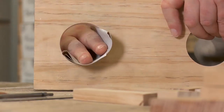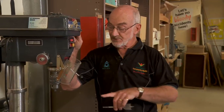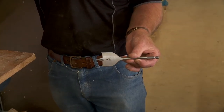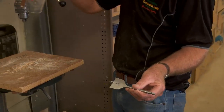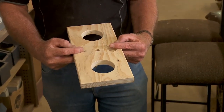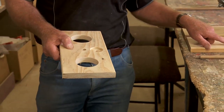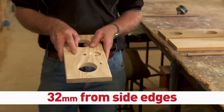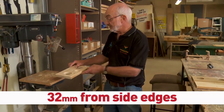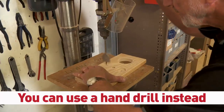Just a bit of sanding on those inside edges there. Our next hole is not going to be a complete through-and-through hole, so instead of using the hole saw we're using a 38mm spade bit. We're also going to use the drill press for that for ease of operation. I've marked where these holes are to go — again they'll be central that way, not that way. The centres of those are 32mm in from the edge of the top. Using a drill press makes life easy, but it's all very manageable with a hand drill — no problem at all.